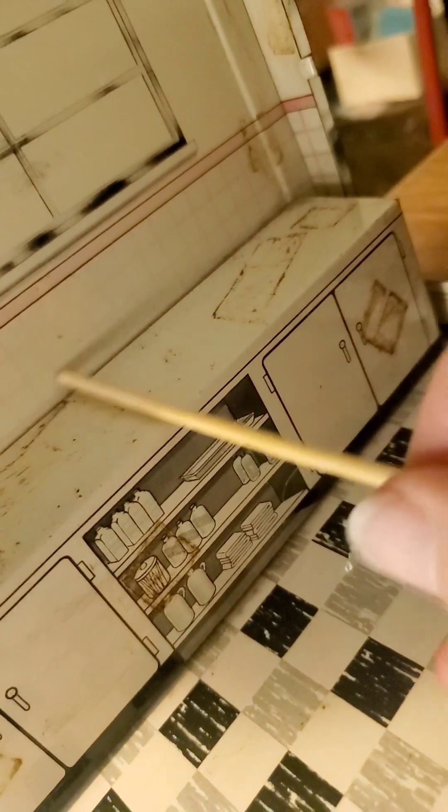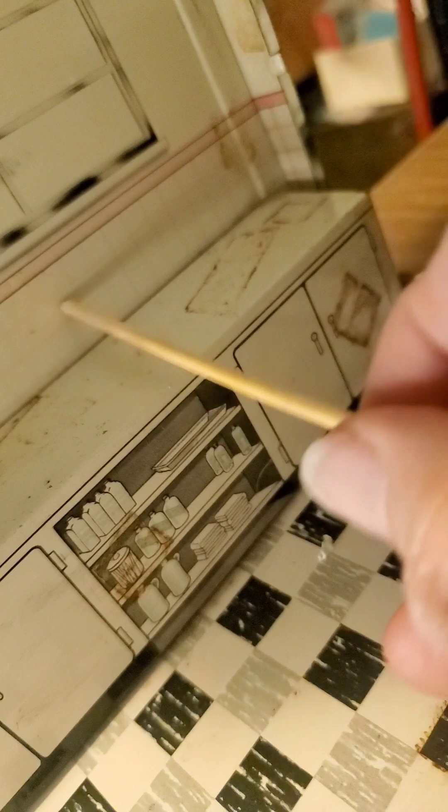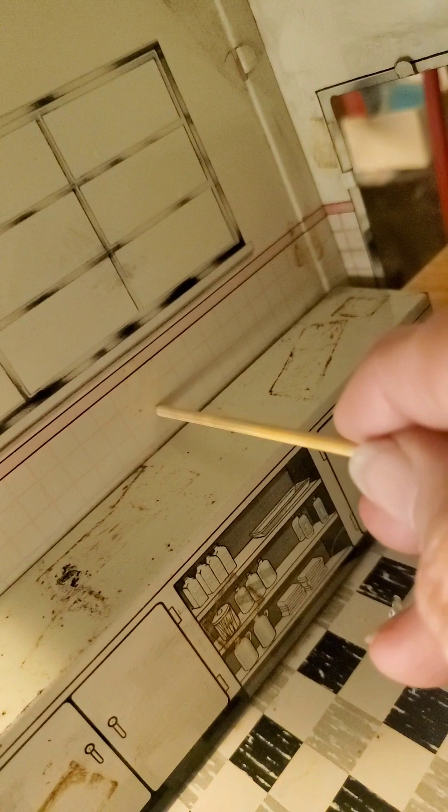I worked on that just another 20 seconds or so off camera, and you can see that really bad spot is now completely improved. So remember the technique: wipe it with a damp cloth, rub it with your wooden stick — the blunt end — a little bit, then wipe it off and see where you are. Then rub it just a little bit more. Always keep track and make sure you're not removing the paint along with it.